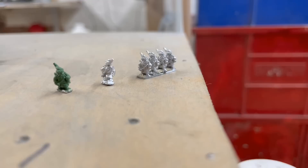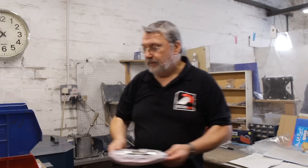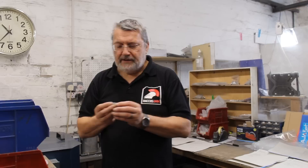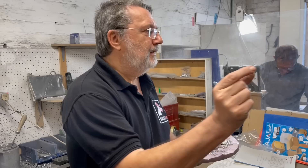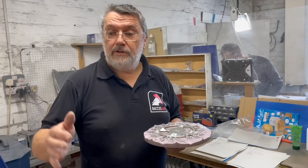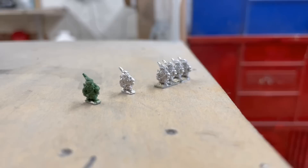So now we've got this little chap. What we then do is that mould gets spun and spun and spun, so we end up with lots and lots of these until we get enough decent castings — four decent castings — and they're stuck to a little strip like that. You'll see here we now have a strip of little streltsy. That is what we call a pattern. So if you think of it, we've got the stage of a sculpt, a master, and a pattern.